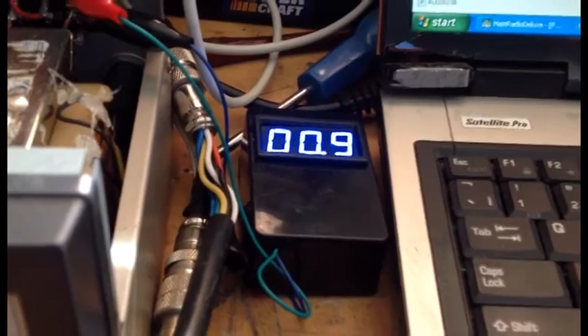We're not too far off 120, 90, but we want it more accurate than that. So what we do is we send an O command, press enter and we get: 'Rotate fully counter-clockwise then send the keystroke.' At the moment, where this rotator position is, we're getting about 0.9 volts from the feedback circuit inside this rotator housing. We're going to be working on the Azimuth first, which is just O.